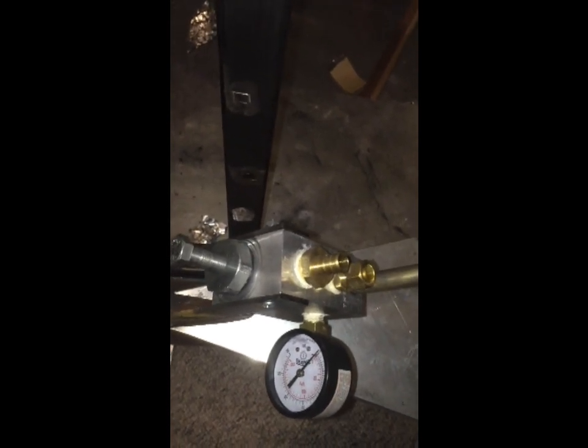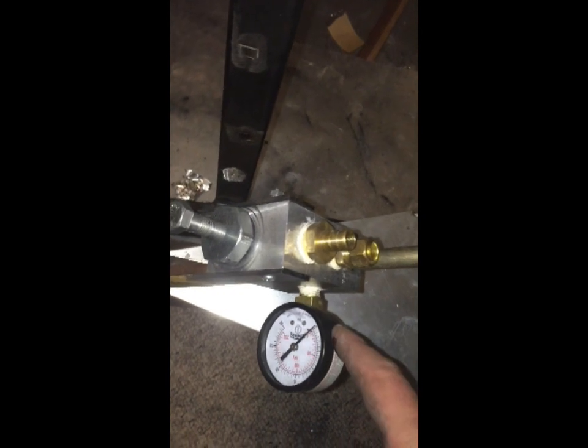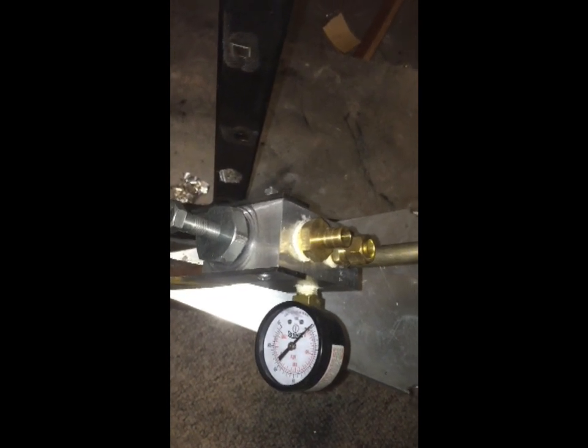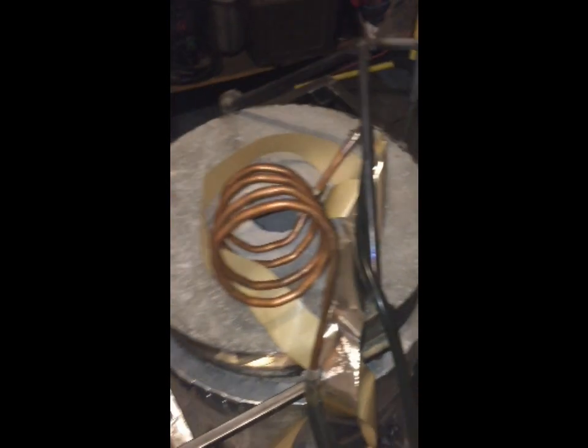to the oil control block. And this oil control block I will go into more detail on sometime later. But this was my own invention here, and there's a little ball valve on the inside of there that maintains pressure, and by tightening the screw on the top there, it'll put more spring pressure on that ball valve and it'll increase the pressure. And then I've got a little pressure indicator here that'll tell you what the pressure level is at. So there will be a continuous cycle going from the pump to this back to the collection tank over there, and that collection tank is going to be the tank that's going to have the temperature monitored on it in order to swing this out of the way.